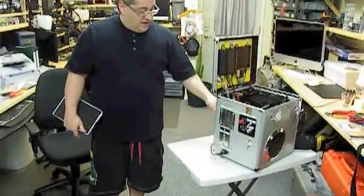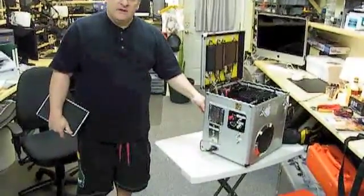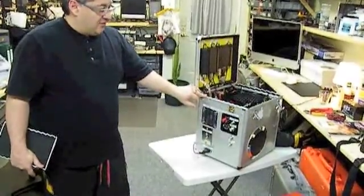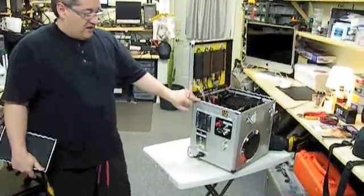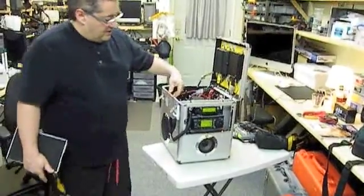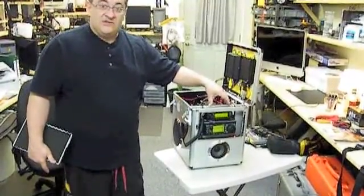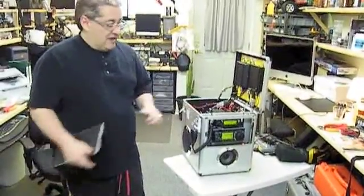There's a ground lug that's going to be used for the HF and also grounding of the tuner to give us a good RF ground. In essence, that is the box. Its composition is a very thin aluminum over a very thin plywood. The box was purchased as a unit called a slip seat, and this is used by truckers quite a bit who move from one vehicle to another. It is configured to take two units — in the trucker world it would have a DIN-type AM/FM cassette/CD insert on one level and a CB radio on the other.